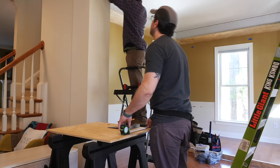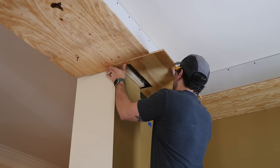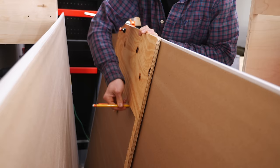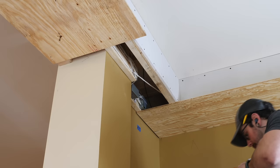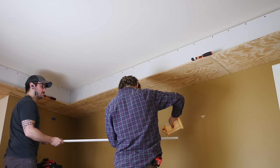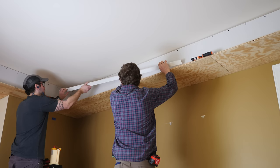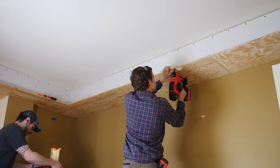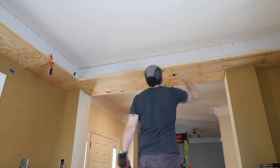The next area to notch was a little trickier as the column protrudes from the wall and then jogs back in, but we got it cut with careful layout. After test fitting, we transferred that layout to the corresponding piece of drywall to avoid mistakes later. Once the marks were transferred, we attached that last piece of plywood to finish off the plywood sheathing. The next step was to attach a 1x2 nailer to the front edge of the horizontal plywood, which would help align the plywood edges where panels met and provide a place to nail on the 1x4 trim later. We attached the strips with wood glue and 1-inch brad nails, clamping some together while the glue dried.